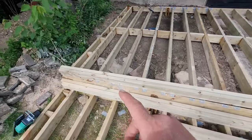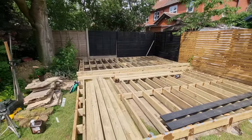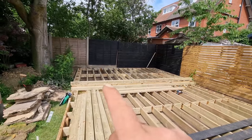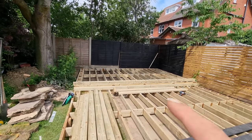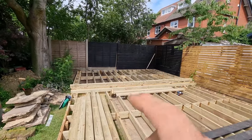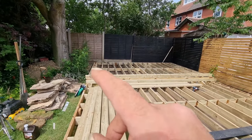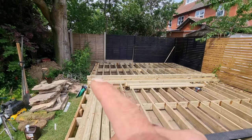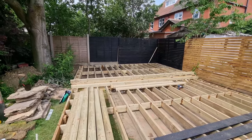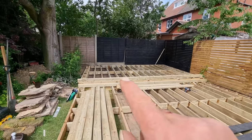4.8 is near enough 5 meters. We're going 500 mil centers. We don't want it too busy on the wall. So 4.8 is 5 meters near enough, divided by 500 will give me 10 spaces, 11 studs. I'm doubling up on the corner, so 11, 12, 13. These ends are 3 meters, so divide that by 500, six spaces, seven studs, so 7 and 7, 14 and 13, 27. And for the front here, we've got that opening,